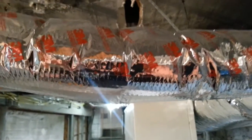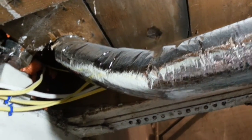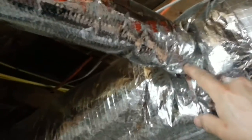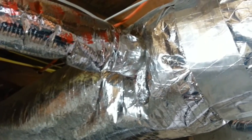After the supply tubing we have sound attenuation. As we come through the floor, this is our sound attenuator — it acts like a big muffler. Then we connect to our supply tubing and run to our plenum. We want to keep these a minimum of six feet long. They also have balancing orifices that can be installed inside the takeoff if you have balance issues — they have a 35% and I believe a 15% orifice.